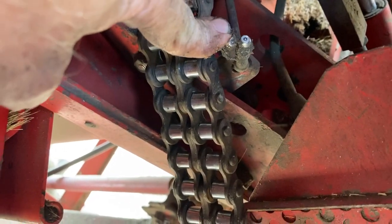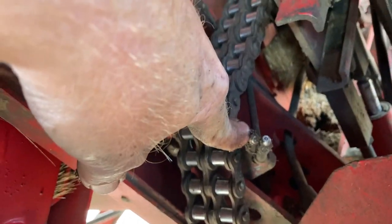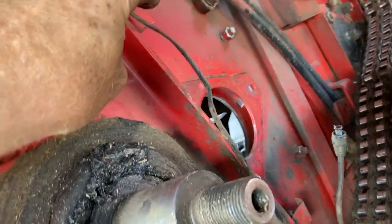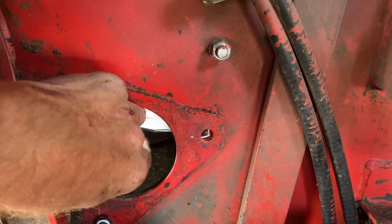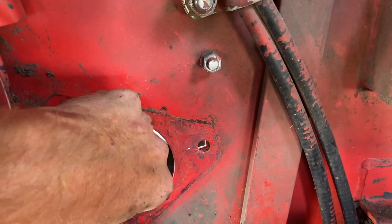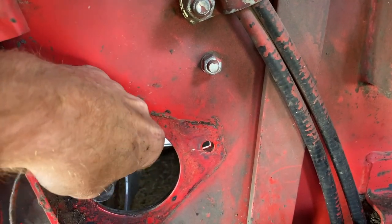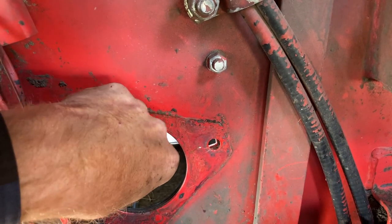You can see down here there's a couple of grease circuits that connect to these hard to reach bearings, and one of them goes to this one and one goes to the other one where the seal was gone. And let's see if I can, that's it there. So I think our shaft is still in pretty good shape. There is a groove in it, but I think it's a grease groove. I don't think it's wear.